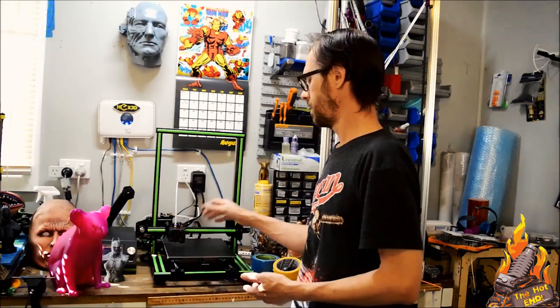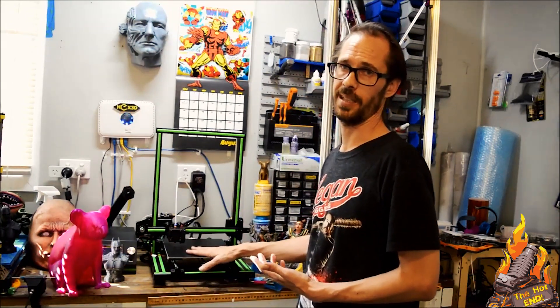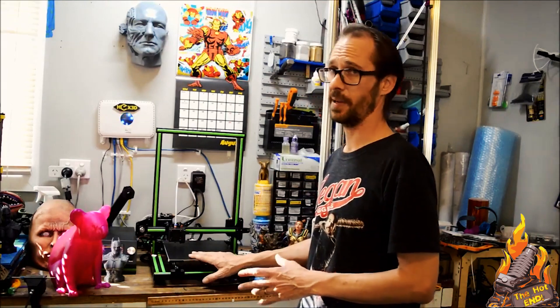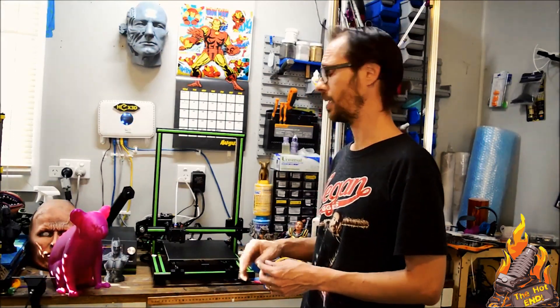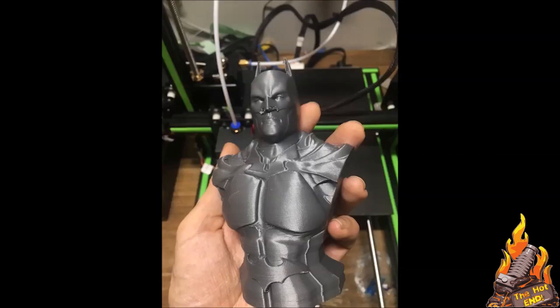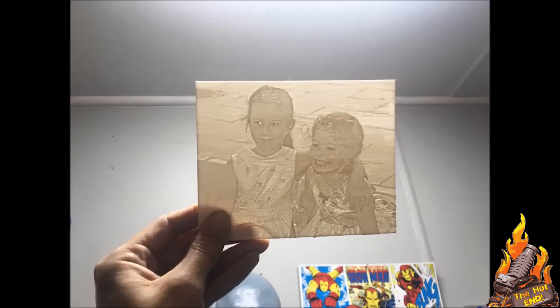This is a PLA example that actually turned out pretty well — printed at 0.2 millimeters. This one didn't fare so well, only because of the cooling really. If it had better PLA cooling and a bit of better retraction, it would have been great. And finally the ABS — to be honest, I didn't have a problem with the ABS. I was quite happy — no curling, no warping. Not too bad. And this was just a small lithophane test which actually came out pretty well besides some retraction issues.